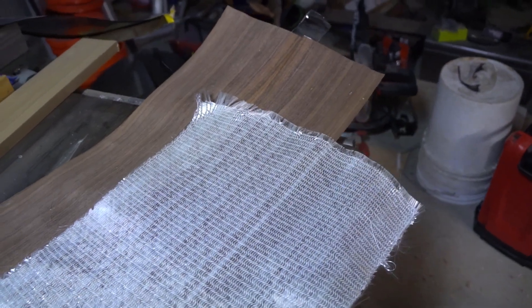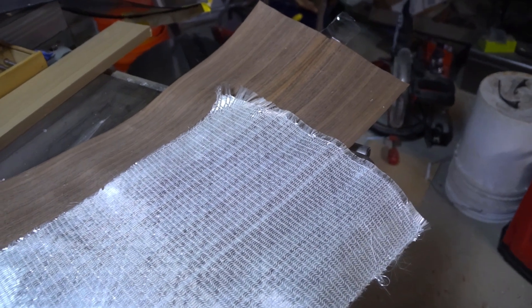Lastly, I drilled holes and glued pegs in place for my core and base alignment, and boom — we're done, all caught up and ready to press. I've got my new base sheet and edges, my new core and sidewalls, my veneer top sheet left over from last time, and my glass cloth ready. I've also got a new epoxy formula to try — the pot life is twice as long as the last one and it claims to be thinner, which should make wetting everything out much easier.